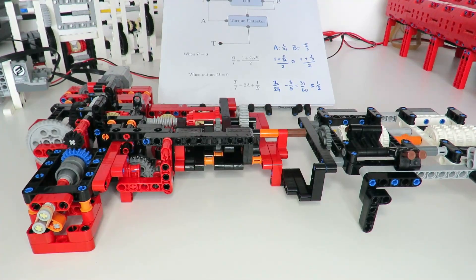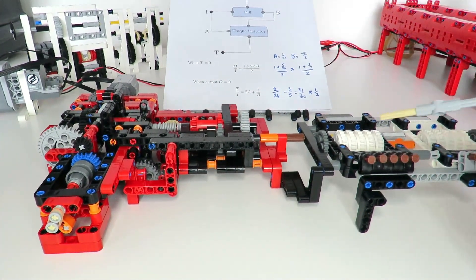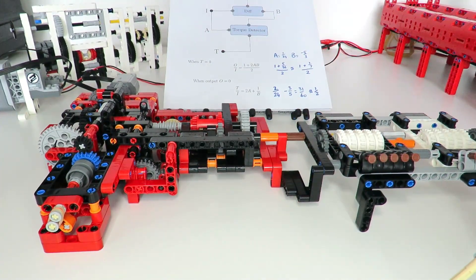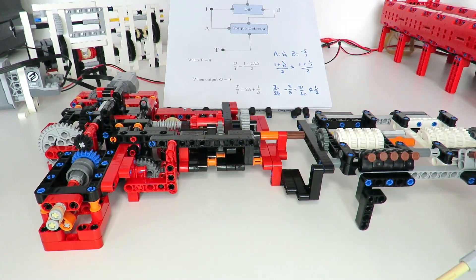This redesign shows that reducing the number of gears in the implementation dramatically affects torque output — we gain about 40% extra torque just from that stage. By better understanding the relationship between the differential and the torque detector, improved parameters can be chosen. The a and b parameters do contradict each other and b is quite tough to choose well, but a good compromise was found. Hopefully you've enjoyed this video — please like and subscribe and we'll see you next time.